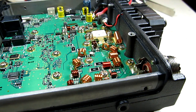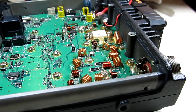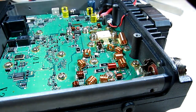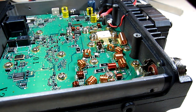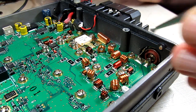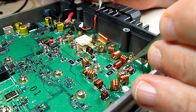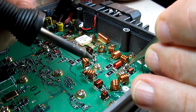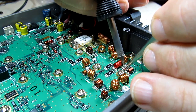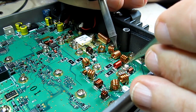With one side prepped, I apply a little bit of flux and then bring the parts in to solder one side of each. Sorry about bumping the camera. With the flux applied, I bring in the first PIN diode — cathode oriented toward the left — confirming the right orientation, and get the soldering iron in at the right angle to solder one side down in there.